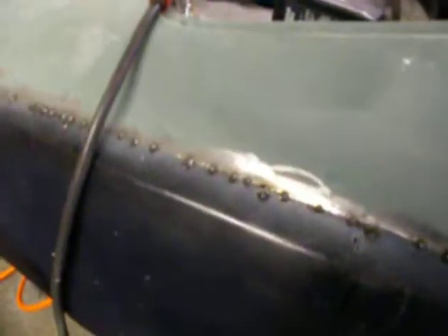This seam is actually not a butt weld — it's a lap joint. What I did was I flanged the existing steel, cut it a half inch bigger than this panel, and then I have a flanging tool which makes a step so that this panel rides into. It's all in pretty good, all tacked for now. I'm not laying huge beads — it's all in place, laying flat, with some dolly work needed to get the lows and highs off.